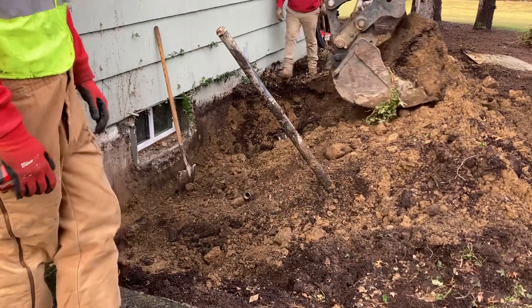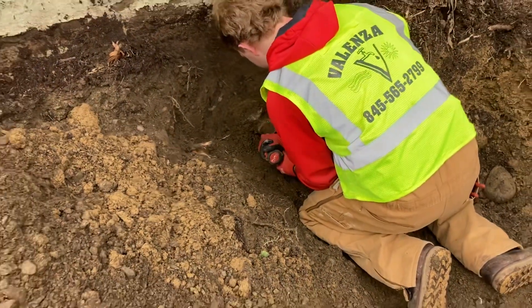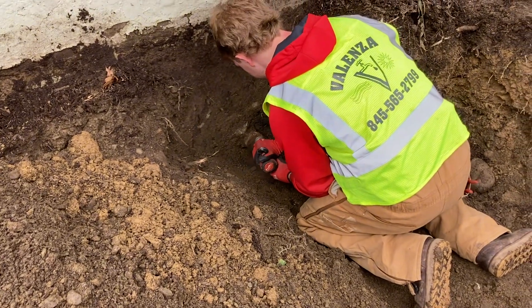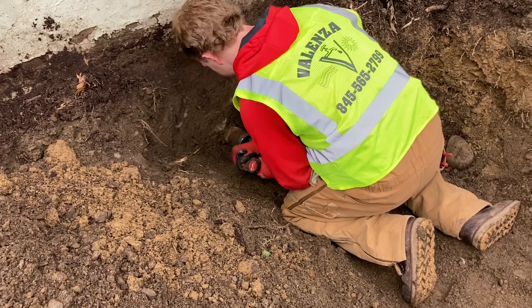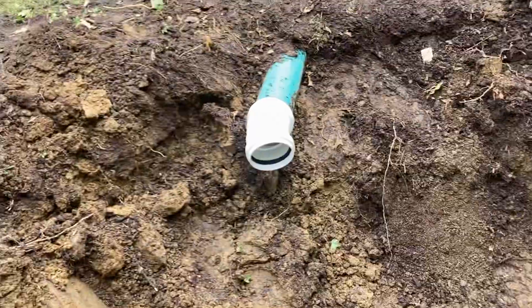We'll show an inside clip of what it looks like when we're done. The guys did a great job getting the lay of the land all pitched right and cleaning up the copper. It's copper penetrating through the foundation wall and we're going to get it smooth so we can put our transition bands on there, bedded in really nice so there's minimal risk of it sagging. Here's our septic tank and we're going to Y in a couple different penetrations from the house with SDR 35 gasketed fittings.